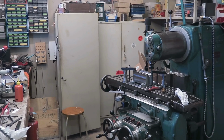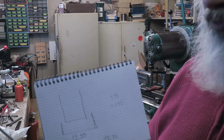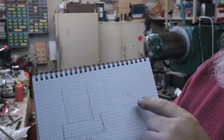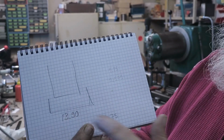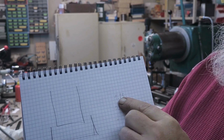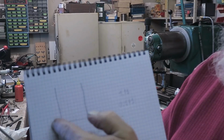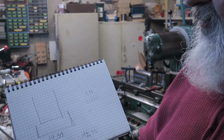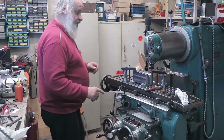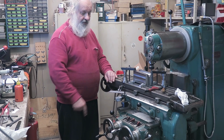The surface finish is so bad that I got different readings all over the place, but this is a good average. When we subtract from that one, we get the difference of the widths. Then I split that into two, and this is how much it should be on each side. So now it's 0.575 millimeters, and I already moved the Y direction using this dial indicator.